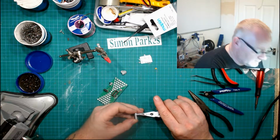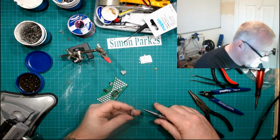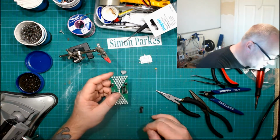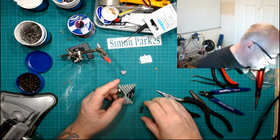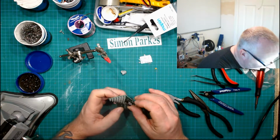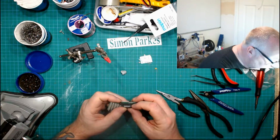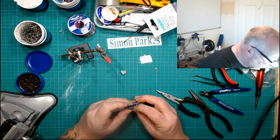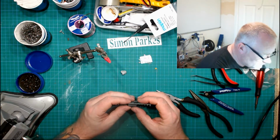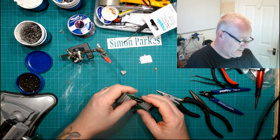This is easier than it looks. No, sorry, it's more difficult than it looks. So we've got the cutout at the top of the chip, indentation, indentation there, indentation there. So that means top left is number 1. You've got to have your tongue hanging out when you're doing this kind of thing. There we go. Make sure all the pins are in, and there. It's home.